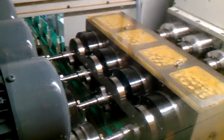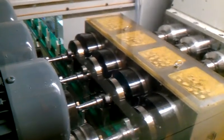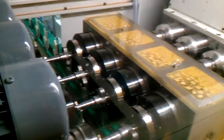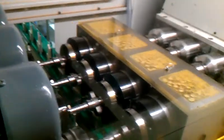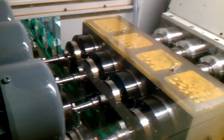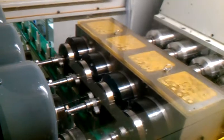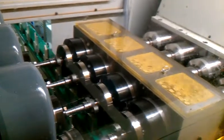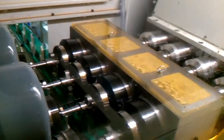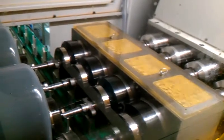The material is an alloy steel, which has a fairly high carbon content, and we're drilling with an 11.1 millimetre diameter at 65 millimetres a minute feed rate. Coolant pressure is at 85 bar.